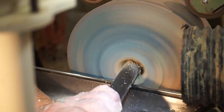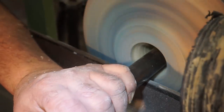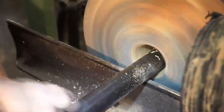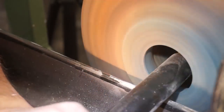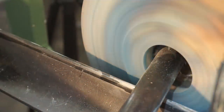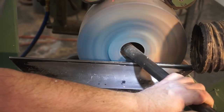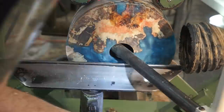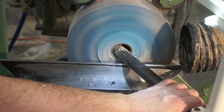This is actually pretty difficult to film - you guys can't really see inside. The problem with this steady rest, which I'll point out in a side shot, is you can see I've got the laser adjusted right on the very tip of the cutter so I know exactly where it is inside the casting. But the drawback from that steady rest is the way it's shaped - so I'm actually going to alter the shape and have the pieces on the side extend upward so it doesn't interfere with the laser arm at the top.